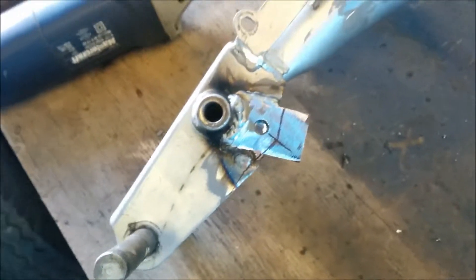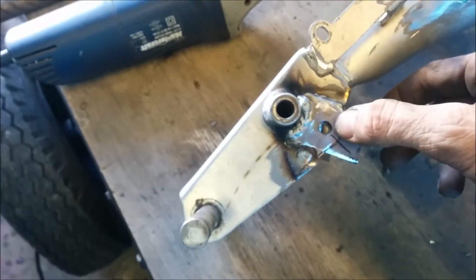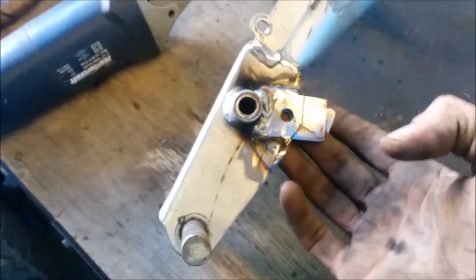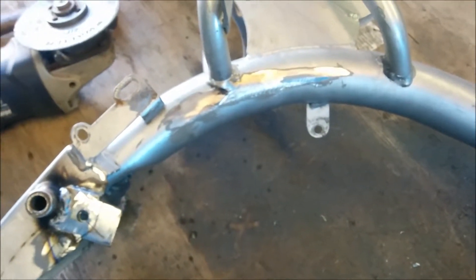I'm going to get the tabs welded on here, ground down a bit, and I got a mark here where I'm going to slice them off and then notch just that little bit of the frame out there on both sides. That way we'll get that, and then we can just finish drilling through these holes because they're not drilled all the way through yet. We'll drill those all the way through, and then we'll test fit the motor and see where exactly we need to put these brackets. Once we weld them on, then we can send this frame to paint and get her all painted up and ready to go.